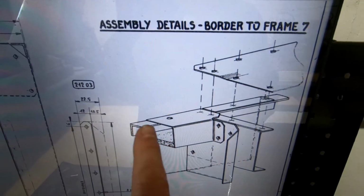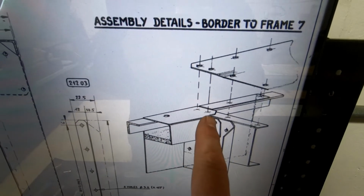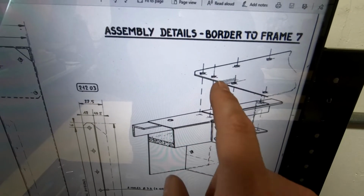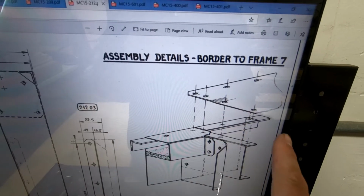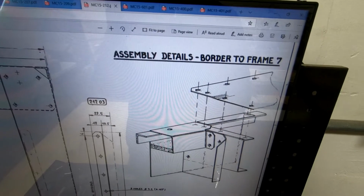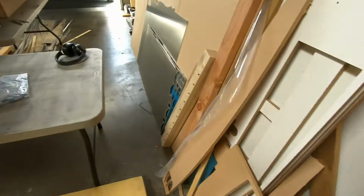So this is that combing that's going to go over the top of that cap. It's supposed to go over the top of the two rivets, one that's on top of that corner cap and the other rivet next to it that's part of the skin there, and then the skin is just supposed to be bent down around that. So the top skin that goes over the rear fuselage is supposed to conform over the top of that corner there.